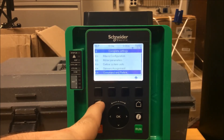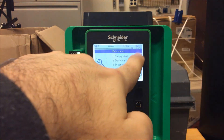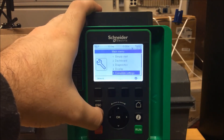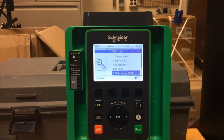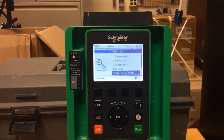To see this in action, press the button and you'll notice in the top right it will go back and forth between HMI and Terminal. And this is how you set the ATV630 and ATV930 drives to allow you to use the local remote button to go back and forth between your two different references.